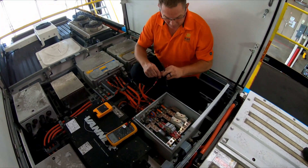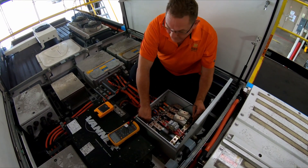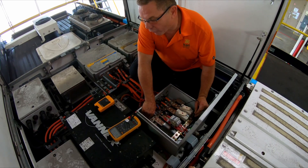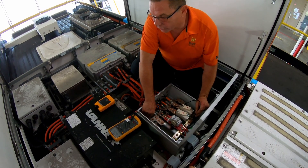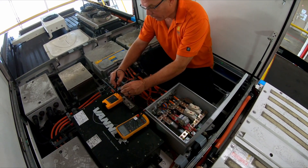I'm going to reverse the polarity — I take my negative to my positive bus bar and my positive down to a chassis ground. I'm getting the same 0.4 volts, which is probably some kind of an induced voltage, but for all intents and purposes that is zero. I go back and make sure that my meter is reading properly.